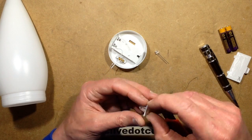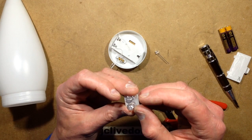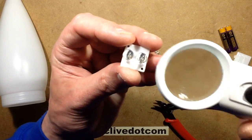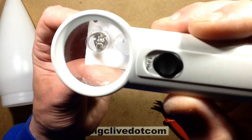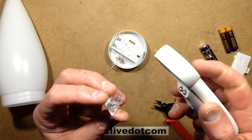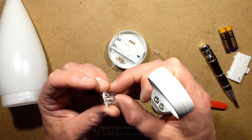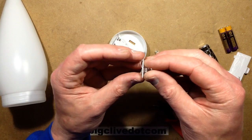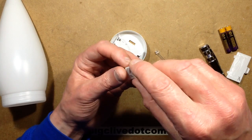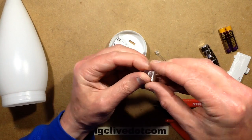It's quite unusual to see the 8 millimeter type LEDs - it's quite a distinctive, unusual LED inside. It's a different construction from normal - it just looks really different. There's normally a plateau with the chip in it, but I think it's because the negative electrode has a much flatter surface for those chips. It's quite neat. These color-changing LEDs have a little integrated circuit inside, along with the three chips - red, green and blue - and all you have to do is supply power and the color changes.